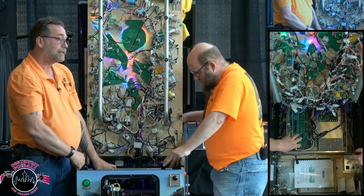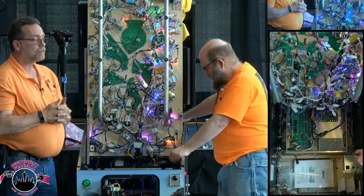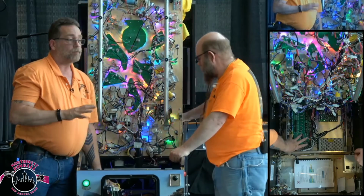Okay? And is that what you found when this game had the bottom half in white, so it wasn't turning the different shades of color, just the white, right? Well, when the bottom half was in white, we had this state. This state gives us a beginning place. So the I/O board in this state is good. It gives us what we want and what we should have.